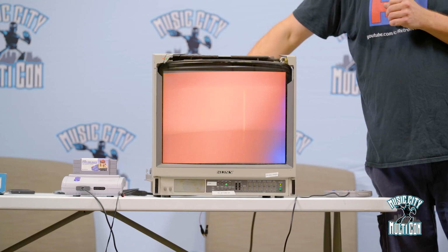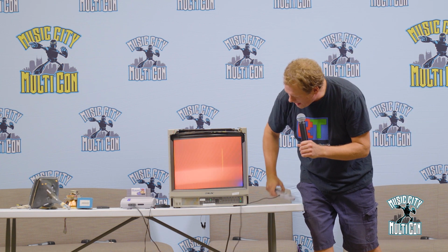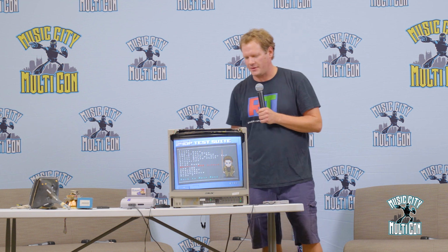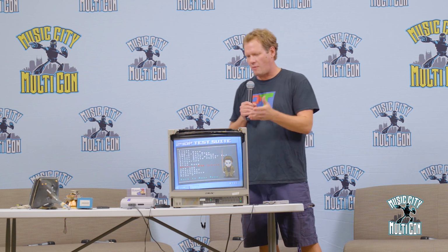Okay? The other thing that may happen is you may have components that go bad on the board, and that's normally electrolytic capacitors. What that will do is make it so the adjustments that I was trying to make wouldn't actually do anything on the screen, or they would make the screen not look quite right. It might always look oblong. It might always have a hook at the top.